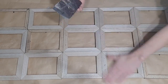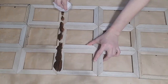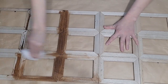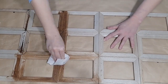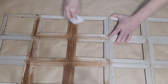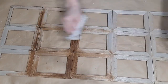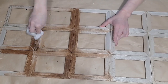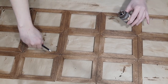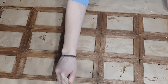Now I'm going to take my little sanding block and sand over where those little metal tags were to make everything smooth. Then I'm going to put a generous amount of antique wax on a paper towel and go all over this frame, rubbing it on and then rubbing back over it, blending it in. I go back and forth until I get a really nice deep brown color. This is Waverly Antique Wax, and I also take some on a little brush to do the insides of the picture frame just in case that is visible.